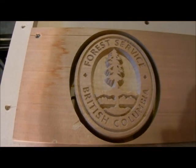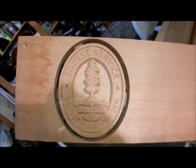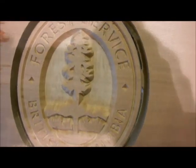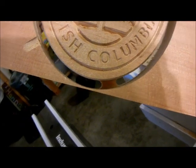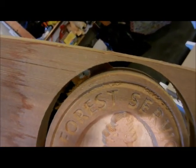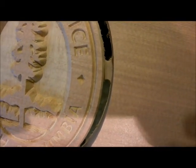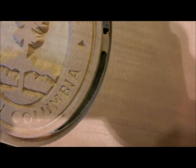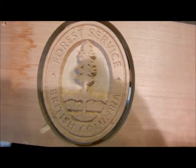Hold on and we'll see what it looks like after I remove it. So we removed the board from the machine just seconds ago, and it was a pretty good cut, right through. There's a tab, there's another tab, another tab. Those tabs — I can set them to whatever I want. They're set to one eighth of an inch in height, half inch thick. I cut them out and sand those tabs off, and away we go.